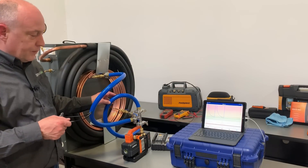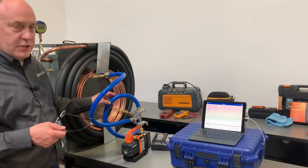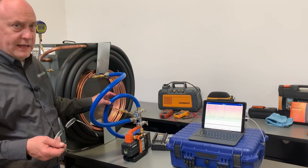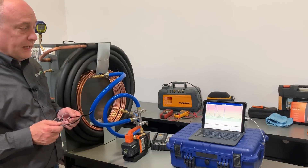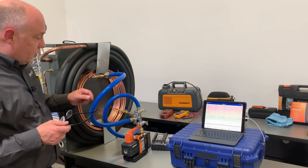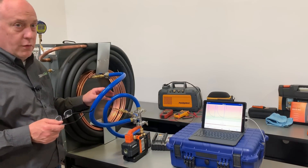After it runs at this lower speed for a few seconds, it'll probably ramp back up to the higher speed. It's just probably how they're programming the batteries so you don't drain them too fast on the pump. But we're doing successive pulldowns, so we're running the pump a little bit harder because with these True Blue hoses, we're making that pump work at a full 2 CFM.